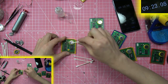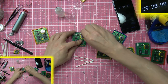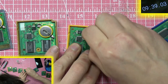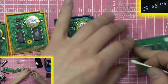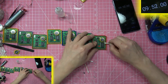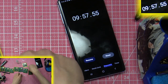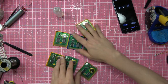We're still not done — now we've got to clean up all the flux residue and a little bit of the rosin residue from the rosin core solder. We're hitting it with alcohol and a Q-tip, trying to do it as fast as possible. Oh my god, can we do this in under 10 minutes? Ten minutes for eight batteries. Boom — 9:57, done!